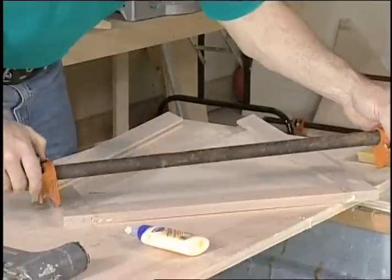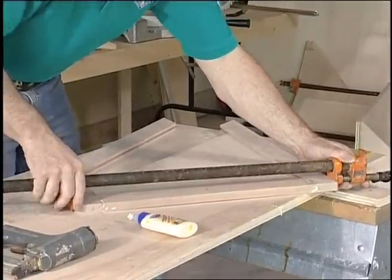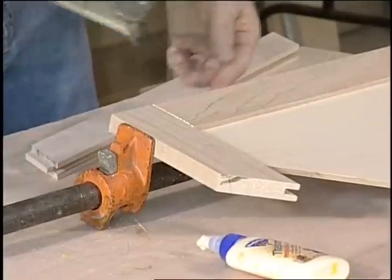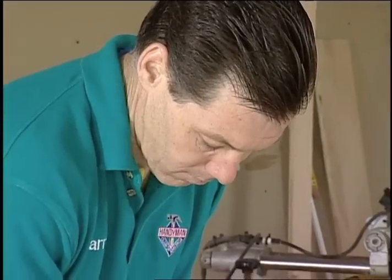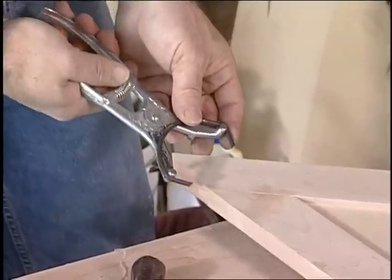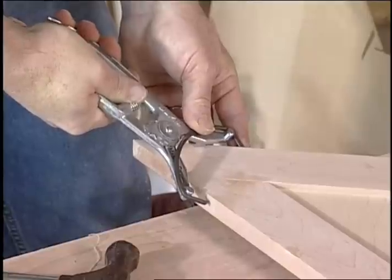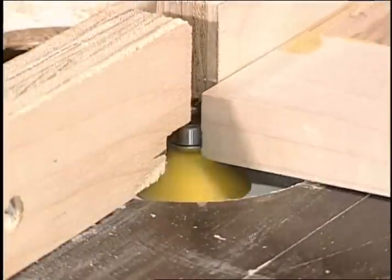Glue the ends together and fit them, sliding the panel into the groove as you go. Work out your clamping strategy ahead of time for an awkward shape like this one. Clamp the pieces together, making sure to keep the clamp from making contact with the wood, and align the clamp so that pressure is applied square to the work. On the backside of the drawer front, nail a five-eighths inch brad from the groove edge into the tongue. Glue and install the angle piece using shop-made blocks or a spring clamp — the ends of the spring bite into the wood to put pressure on the joint.